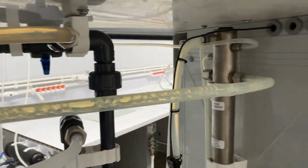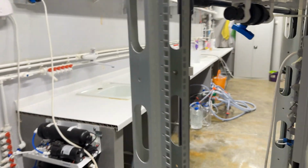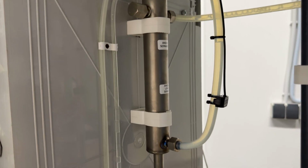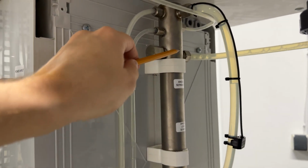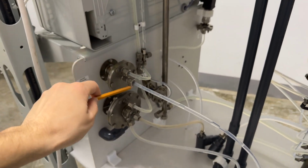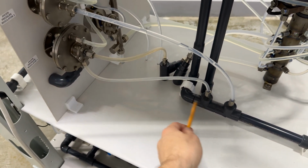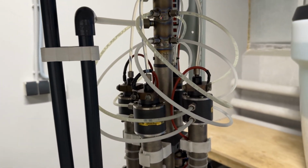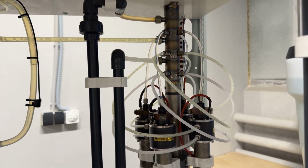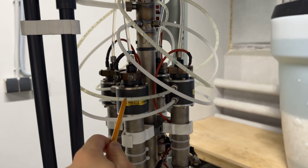Here these oxidants go into the separator. So the core idea of this separator is that the brine, which is not converted, goes back to electrolysis, and gaseous oxidants are separated here and go to the pressure regulator to be injected in the water flow and out of the device. Let's look from this side. Outlet of caustic with hydrogen, outlet of oxidants with brine solution.